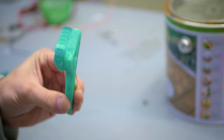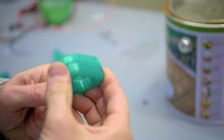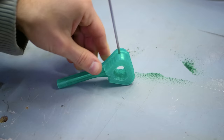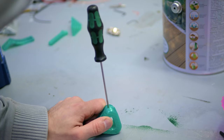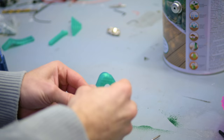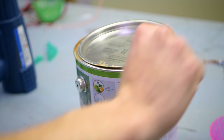While that is soaking in, let's check back on the acetone-welded PLA parts and see if we can separate them. And by the feels of it, these have really bonded well. Even hammering a screwdriver between the two parts didn't separate them — the screwdriver did deform the parts, but they didn't come apart. So in this case, I'd say these are very properly welded together. There was no extra adhesive used, no superglue, epoxy, or anything else involved — it was just two natural, non-sanded PLA surfaces.